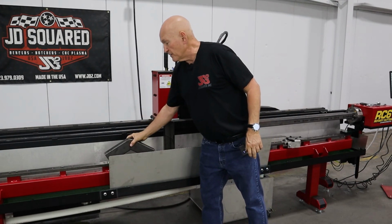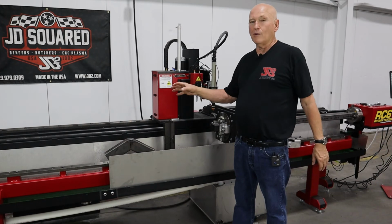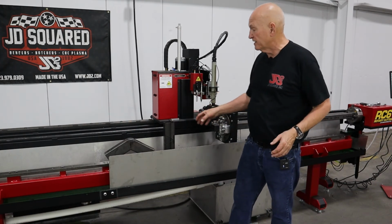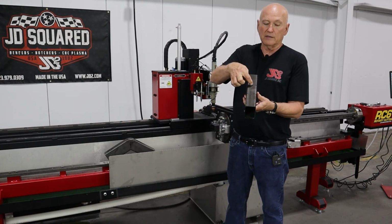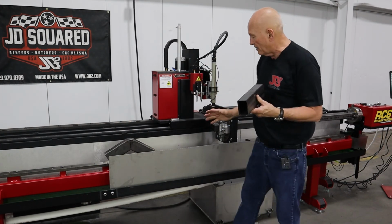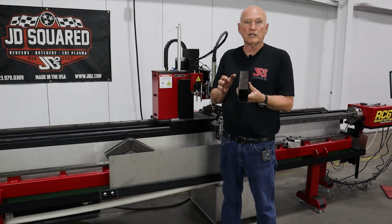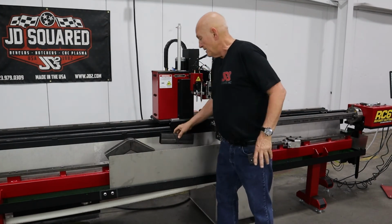We've got the machine working beautifully doing that. The software is working great. I can't wait to shoot that video and show off to you about how well this machine cuts that. But anyway, that's the cut. We would take a slit saw, cut this out here to drop it out. We didn't want to let the whole piece drop out because once again, we're running rollers over it. So we used the split function in Camelot to keep this part intact.